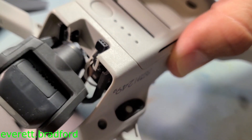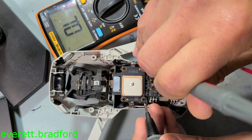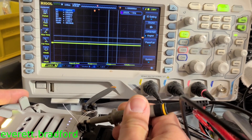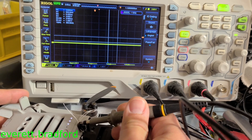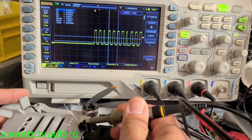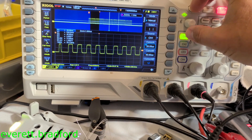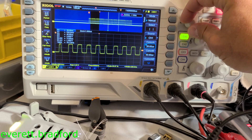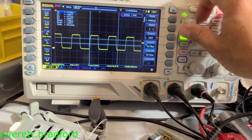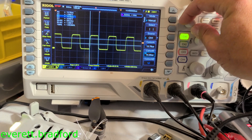While the quad was open, I used a multimeter to identify that one of the wires was connected to the ground plane. Connecting the other two signals to my oscilloscope, I could see that one of them provides 5.1 volts any time the drone is powered on, and the other has a serial data signal. This signal sends out 48 bits of data every 20 milliseconds to control the color of the lights. The bits are encoded as short and long pulses, just like a WS2812B addressable LED, except that they're streaming out at a much faster 780 kHz.